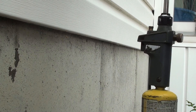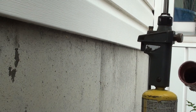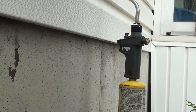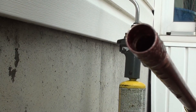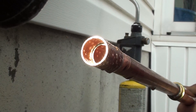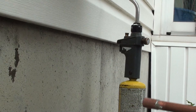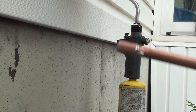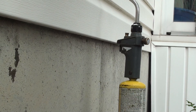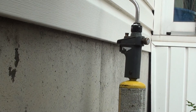To cool it down I'm going to stick it inside the flux again — that also cleans the other side. As I look inside that pipe, even with it at an angle, you can see the solder went all the way around, so we're in good shape. We didn't get any on this side of our coupler. I'll blow inside that hole so I don't get any junk on my clean fitting. I'm going to try to push it in and not have to deal with that. I'm not going to screw it down yet because I need to get inside and connect it.